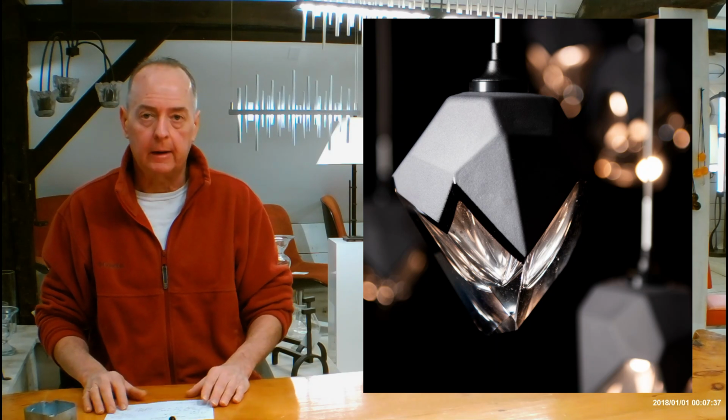You'll notice that they're actually different shapes and different sizes, and they look all different, but they all kind of do the same job. Very important, this is a dimmable fixture without any problem. Just make sure you get a dimmable bulb. Tell your installer you're using dimmable LEDs so they put the correct dimmer on the wall for you.